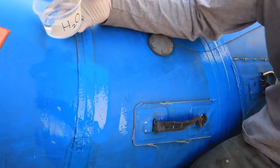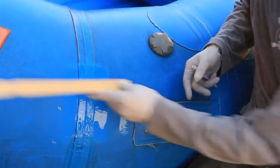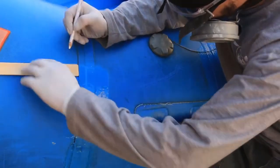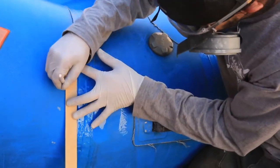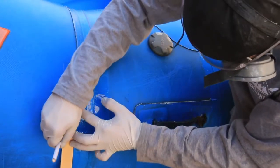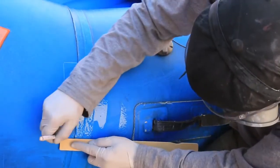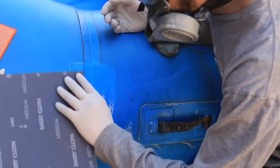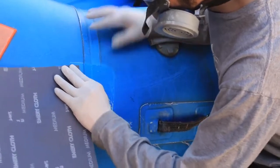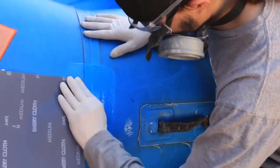Step 4: Do not touch the cleaned area. Step 5: Determine the area you wish to coat and mark the edges of that area with a grease pencil. Grease pencil marks could be a potential source of contamination, so after Step 9, remove the grease pencil marks. Plan to coat an area that is at least 2 inches beyond the area that you are trying to protect or repair. You are going to coat inside the taped area.